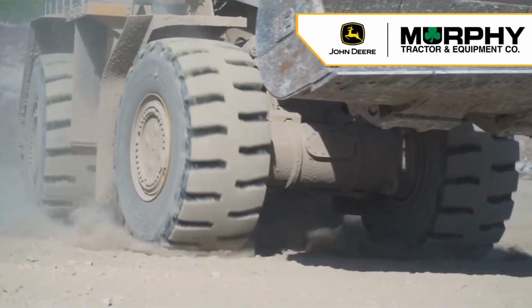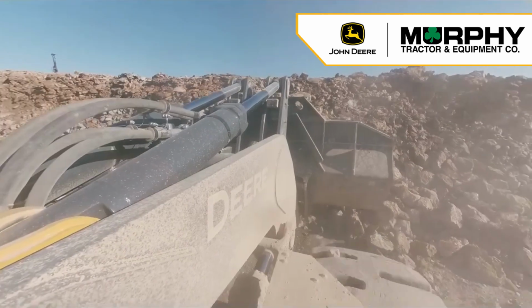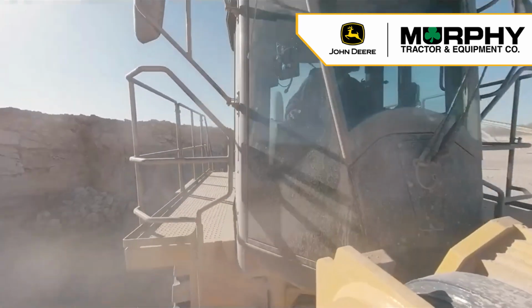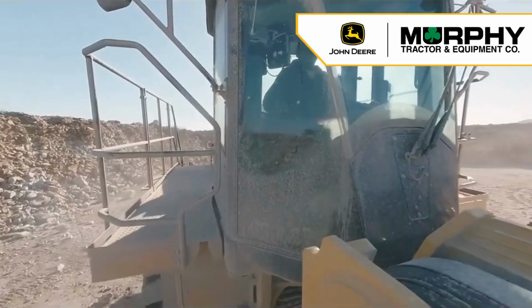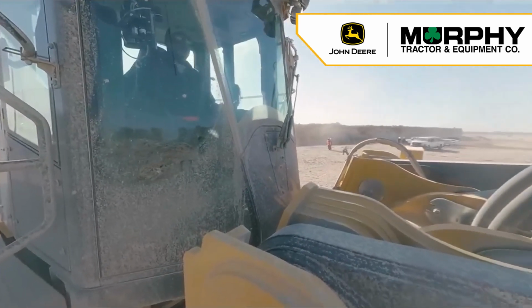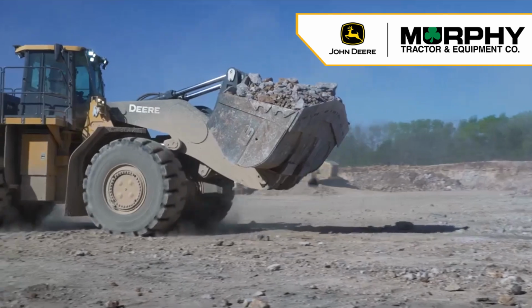One of the customer complaints about the previous buckets they had was that it was rocking back and forth a lot while they were tracking with a full load. So we had to make sure we could reduce the weight by also accounting for using the right material and enough material in those key wear areas to where the bucket lasts a long time and holds up in that environment, but the operator is not rocking back and forth all the time. We can run a lighter Werk-Brau bucket that will have a better survivability in harsh environments than a lot of competitive brands.